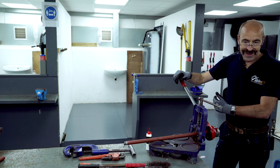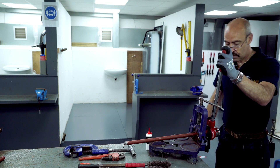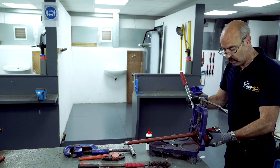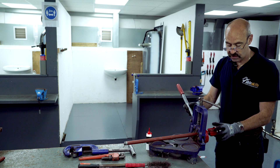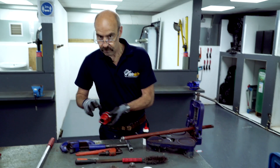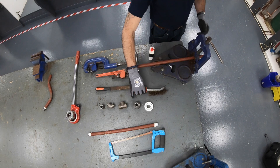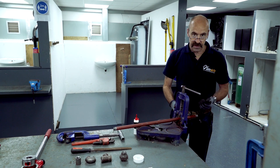We've come to the end of the die — that is it, with a roughly 13mm thread. Reverse it and take it off under control. When it becomes loose, push the die forward — don't flick — just twist it slowly until it releases. And there is a half inch BSP thread. There are little bits of metal on it, so we need to clean it with a wire brush. Be careful which way you use the brush because the bristles will flick and start flicking bits of metal into your face.